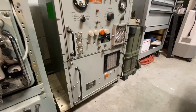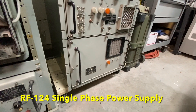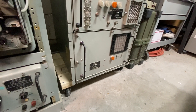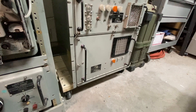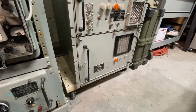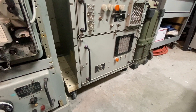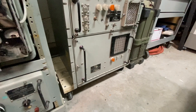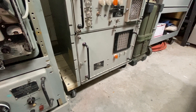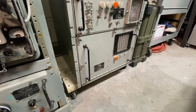I have it stacked up — it is meant to be rack mounted, but I don't have a rack for it at this time. Down here at the bottom we have the RF-124 power supply. It requires 230 volts and is a single-phase power supply. Most of these, especially the ones used by the U.S. Navy and Air Force, were three-phase power supplies — a little shorter in height and probably lighter. This power supply weighs about 200 pounds and is capable of putting out about 2,250 volts at roughly 1.25 amps for the final drivers. Heavy beast — that's why it's on the bottom.